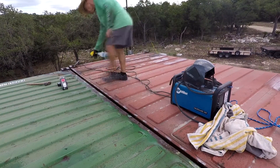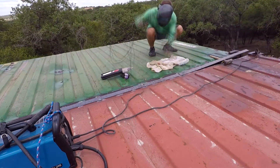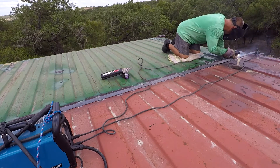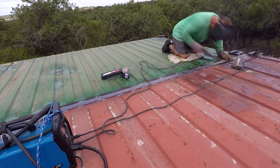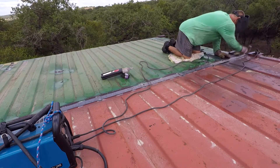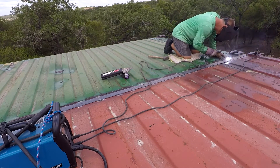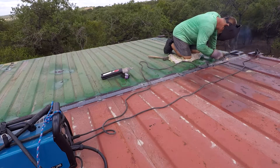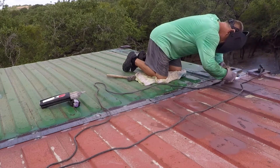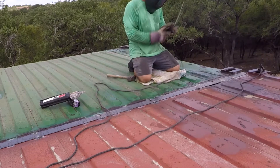Here I'm applying a little bit of that Skyco phosphoric acid to neutralize the rust, then I started welding up the top side - this is on the second floor. I didn't wait for the stuff to dry per se, but it seemed to work just fine. I just wanted to get it done all in one day. You can see me stitching all the stuff here, and then later on that same day I put the Henry's sealer on there as well. A couple hours later we had a huge rainstorm and everything worked just as expected.